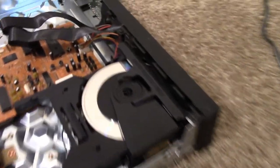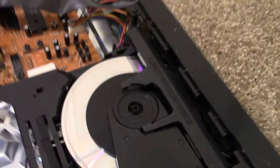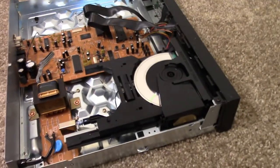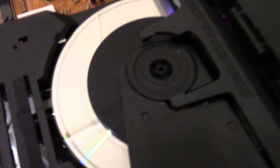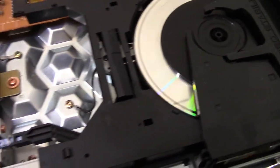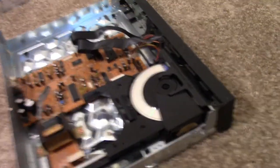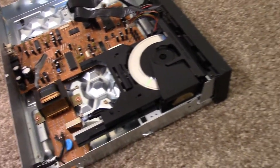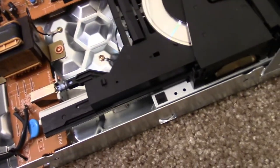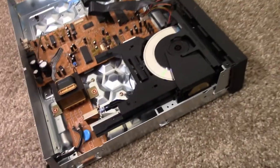I don't know if this upper stabilizer system is particularly special or not. But sound-wise, it seemed to be playing just fine with the main system. It just has a little bit of noise while it's operating. And the little bit of 3-in-1 electric motor oil applied gently with a Q-tip to the laser rail seems to have been just fine. Ideally, any moving part of this mechanism would be using something like lithium grease. I don't have any, and that was just to maybe loosen things up. And it didn't seem to have any issues with skipping.